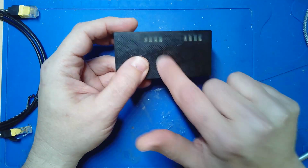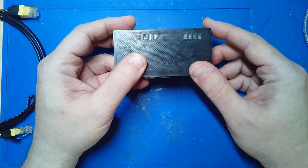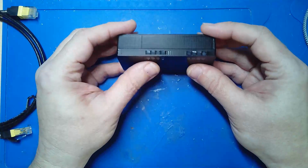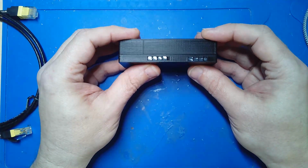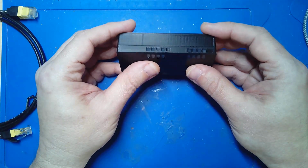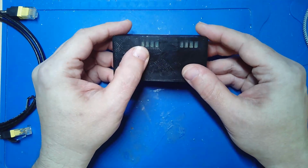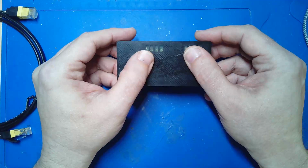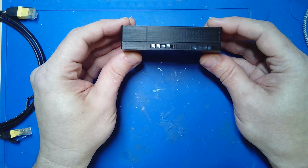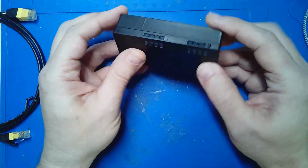One other thing, since we're getting close to mounting this, is I have the LEDs on the front like this, because that's the way that board presents its tiny LEDs. But then we were thinking, well, what if it gets placed in a different position? So I created similar cutouts on the side, or the top, depending on your perspective, so that those little LED faux light pipes that I used with hot glue will show the LED lit here and on this side at the same time. So if we have to mount it this way, we can. If we mount it like this, we can. So we have a little extra flexibility.